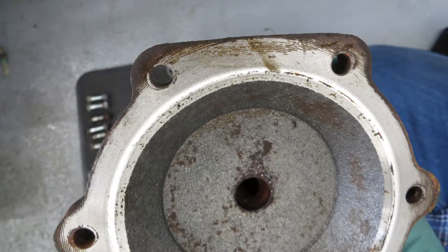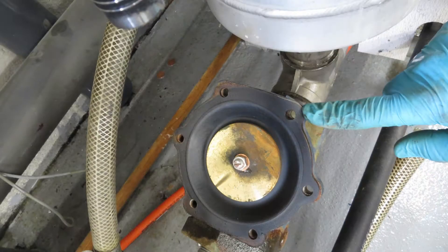Take a look at the inside of the lid for rust and debris. If it's crusted up you'll need to clean it and make sure the mating surfaces are clean and smooth. Then look at the valve body and you'll see a Teflon coated rubber gasket. It may look okay or it may be torn. That's getting replaced so it needs to come out.